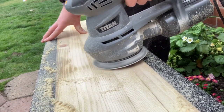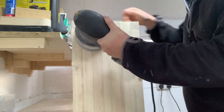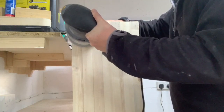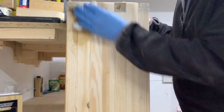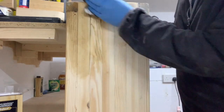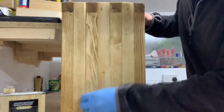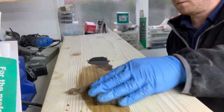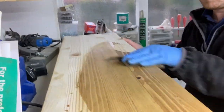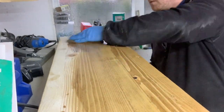After managing to remove the old finish, I then worked my way back up sanding to 100 grit. I then had to put my hand in my pocket and buy some new finish. I bought Georgian medium oak Danish oil from B&Q and as soon as I put the first coat on I was like, wow, yes, this is the finish I was wanting. I applied three coats of this, allowing time to dry in between coats and lightly sanding with 600 grit before applying the next coat. When the final coat of Danish oil had dried, I could call this project done.